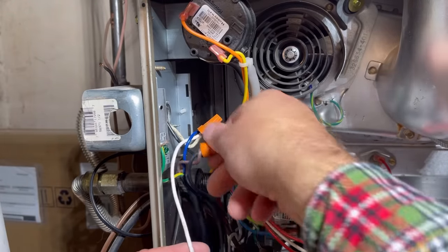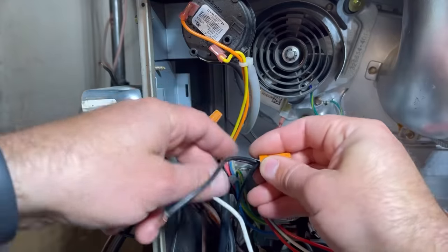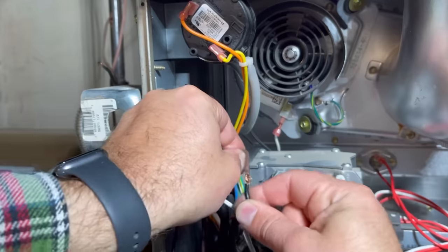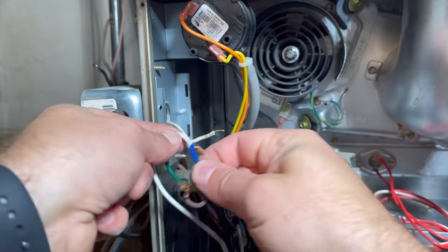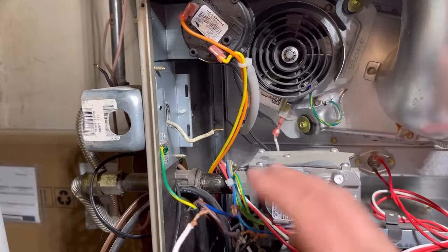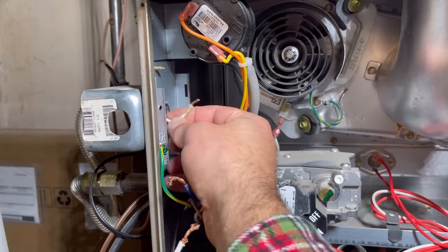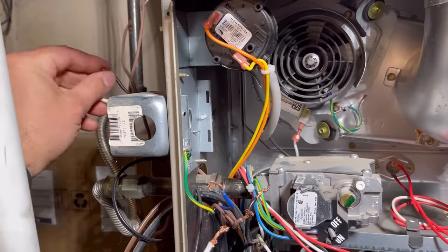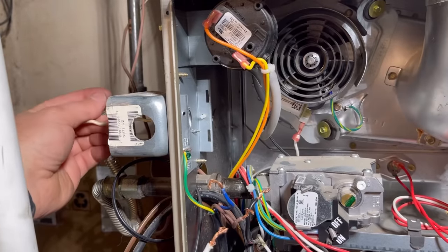All we have here is our main power. We're going to disconnect all these wires and show you exactly what each goes to. This is our neutral here, and then we've got our ground there. Let's put these wires aside for now — right now we just want to focus on our line voltage, so we're going to feed this through, and as you can see on the other side we now have our hot and our neutral. That's what we need to connect our switch.